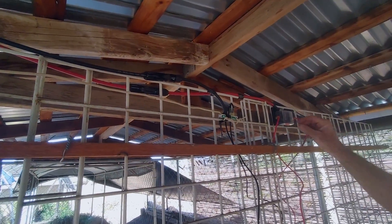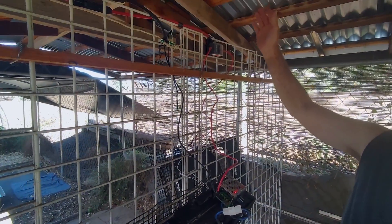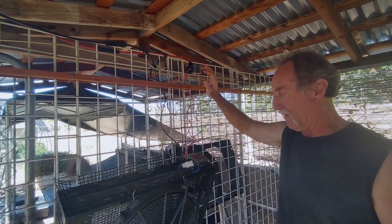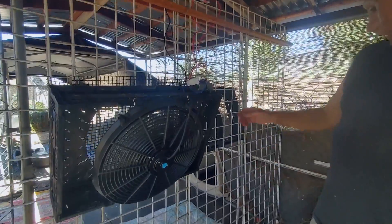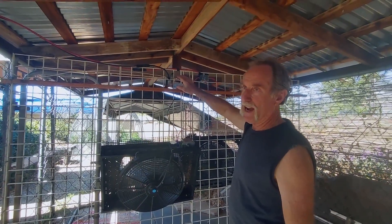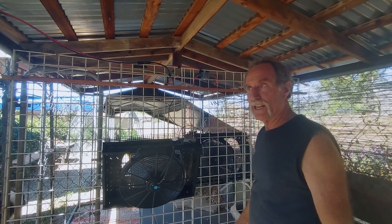If I want to shut it down I can either pull the fuse, turn it all the way down — these will turn all the way off — or just cover up the solar panel. The safest way is to cover up the solar panel, then you can unhook stuff without worrying about power coming in. I checked the voltage coming in from the solar panel at noon and it was about 18.4 volts — actually getting more than 12 volts. We'll see how it does hopefully without a battery.